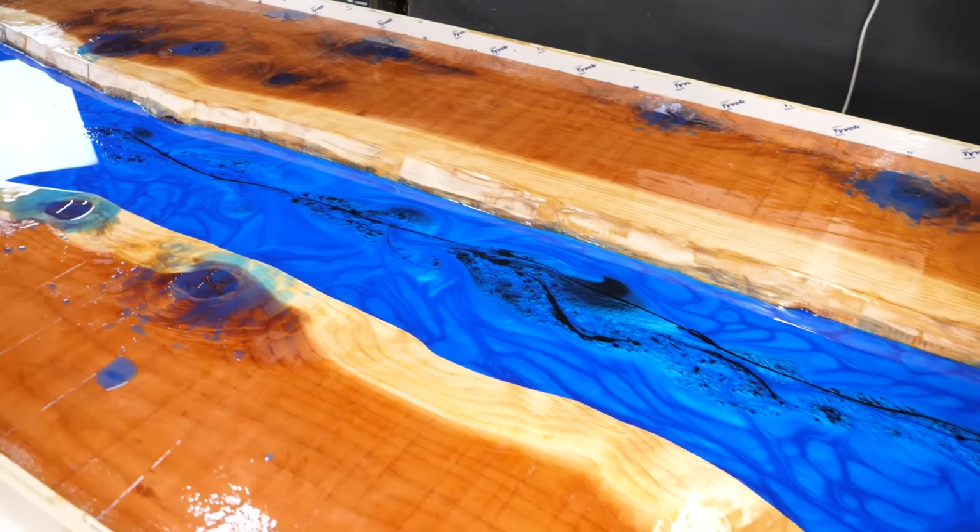Ooh, that's thick. That is thick. All right, I'm knocking off my form boards. Pull out all your screws, and then just use a hammer and pop out any of those form boards. Here I'm taking down some of the overfilled blue that I poured in those knots, and then coming back, wearing my mask, good job, Mitch, and leveling down the table as one unit. I'll do my passes over and over again until I get this bad boy perfectly level.